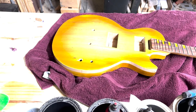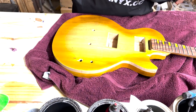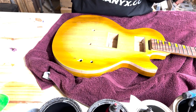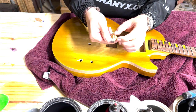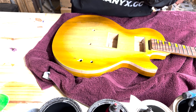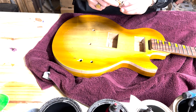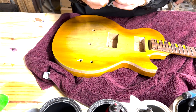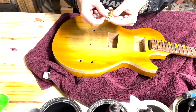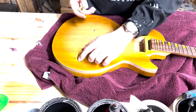There is never a dull day around here. In trying to push the knob onto the pot, there are these little tabs on the bottom that have a tendency to bend out. That separates or decouples the actual pot from the part that holds it in place — this bushing or outside thing. Thankfully, after a little bit of a freak out, I reseated it and just hammered these back in. They're really thin — looks like stainless steel, maybe tin. It's a little bit harder than that. It reseated and all that good stuff, so I'm going to replace this.